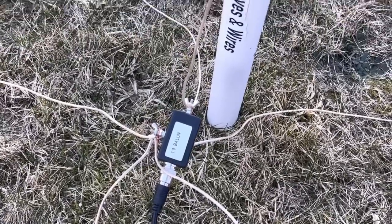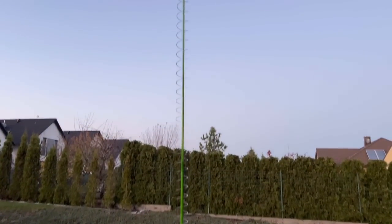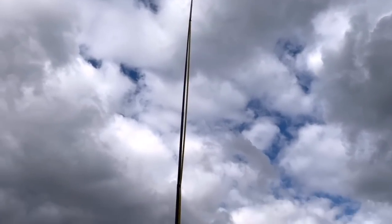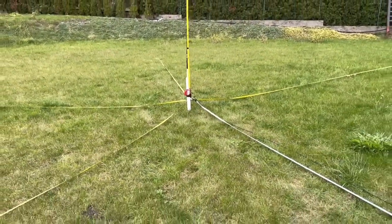I've made some crazy, fun antennas. I've made a helical — I took a random wire and wrapped it around a five or six-meter pole, making a helical random wire, and that worked really well. I worked across the pond with that as a kind of experimental play-around antenna. I've also used a slinky — put a metal slinky on a vertical pole as an antenna. One of my favorites: I worked long path from here in Poland all the way to New Zealand with a tape measure vertical. It's nice because the measurement is right there — you just put the tape up, find your spot. I made one for 20 meters and had a long-path contact over to Australia with that antenna. It proved the theory that verticals are definitely the DX antennas, if you can talk around the world with a tape measure.